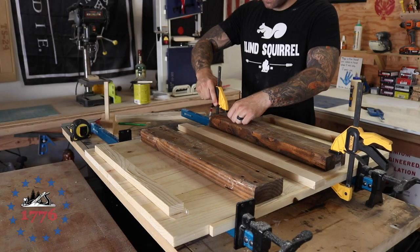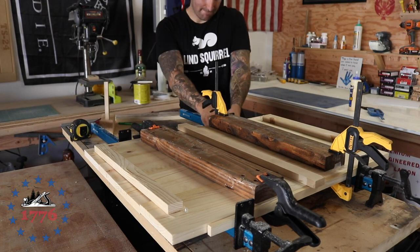These right here are called cauls — it's basically just a piece of wood that has packing tape on it, just regular old packing tape. If you clamp them down across all the joints, it keeps everything flatter than it would be otherwise. When you push pressure in from the ends, things don't start to buckle up on you. It ends up coming out much flatter. If it's not flat at all you might have to redo it, and you just lost however much money you spent on that wood because now it's permanently fused together.